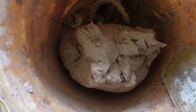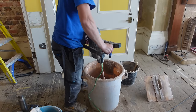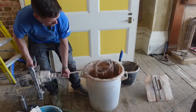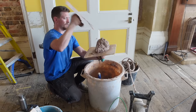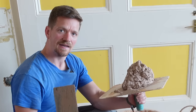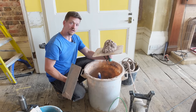We're just going to slowly add water and mix it together, and that is what we're going to use for the base coat. We want the mix to be quite thick — as you can see when you load it up, thick consistency. You'll also notice when you get a close up you'll see all the fibres in there. It's not like they used horse hair back in the day — it's all synthetic fibre, it's in the mix, so all that is included. We're just literally adding water to this and that is ready to go.